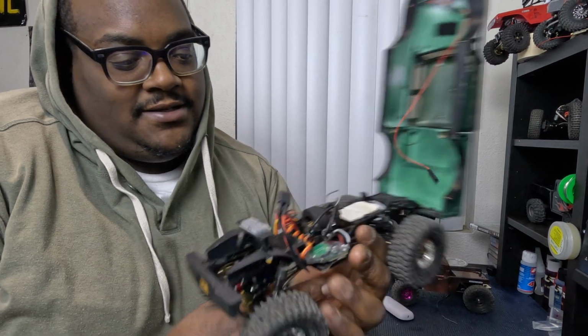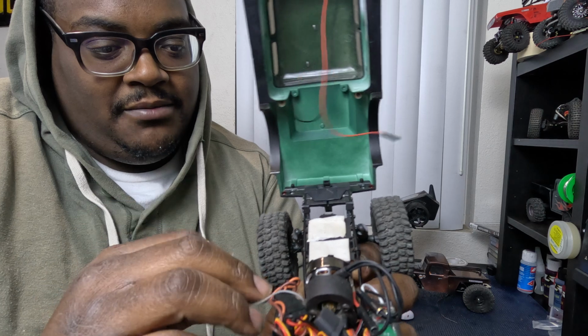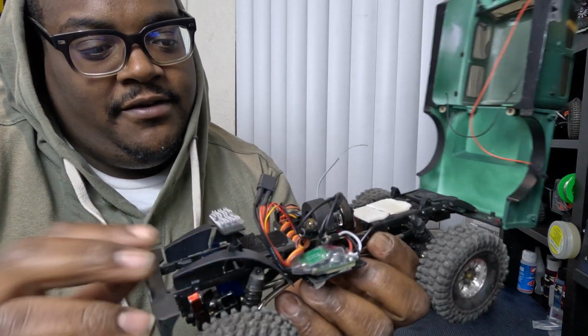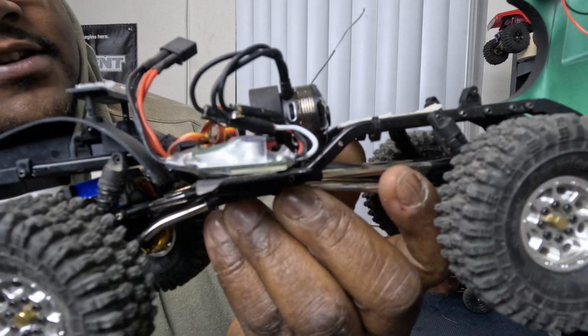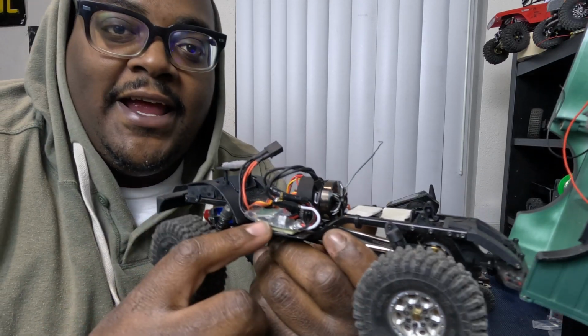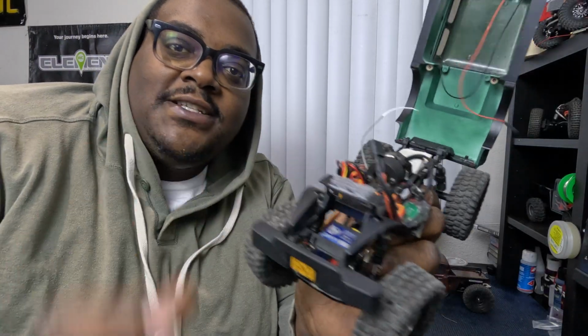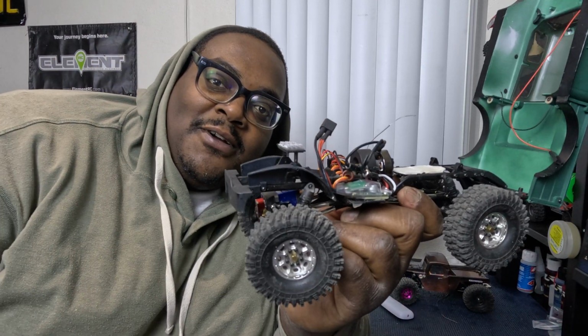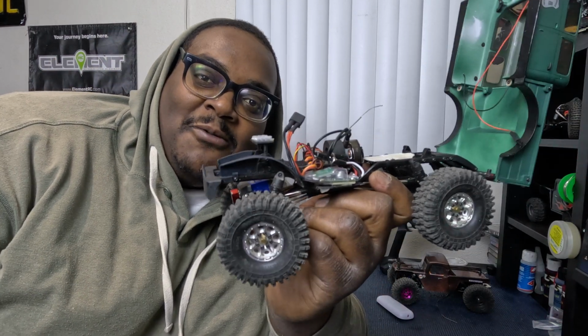And here's the insides. On the inside, I have this OGRC brushless outrunner motor that is paired up with a Spektrum SR315 receiver. And here we have the star of the show, the Castle Nano that I've put my BEC to. And this is running at 8.4 volts on the Enduro 7 kilogram servo. And my battery sits here. So now we're going to give this a test. We're going to show you why I like this setup.